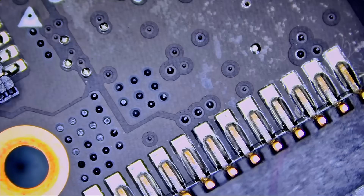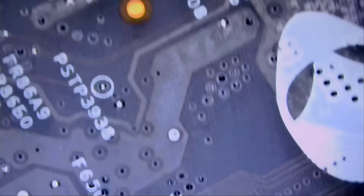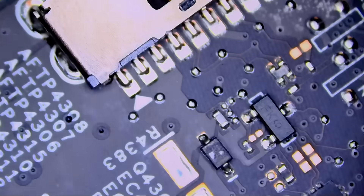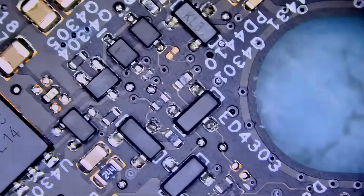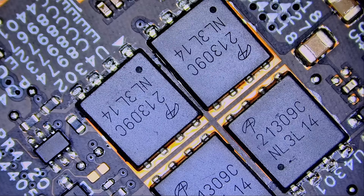Let's see what's going on. We're going to start with the charging connector, which is right over here and connects all the way right here. I want to look for some mosfets, and I do not see any on this side of the board. Let's flip the board and look around the same area on the back — right there we do see the mosfets, four of them.